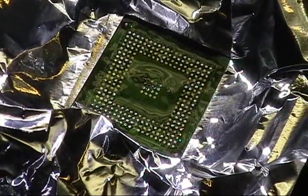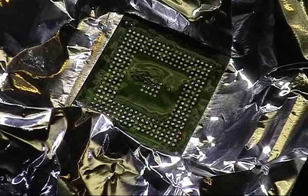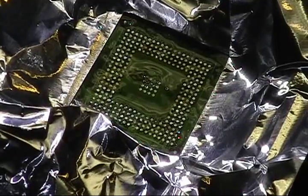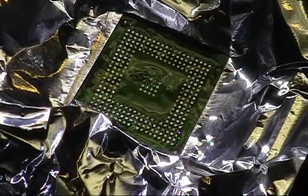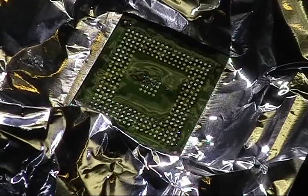Definitely don't pull if the solder wick starts sticking. You saw what I was doing, I was bending it back and forth. You can't just pull up, you pull the pad out. Whoops. If you pull the pad out, you don't even want to know.